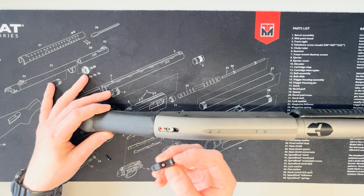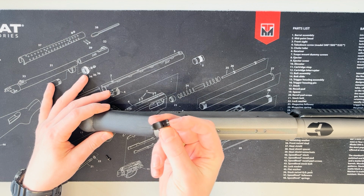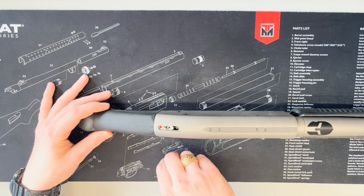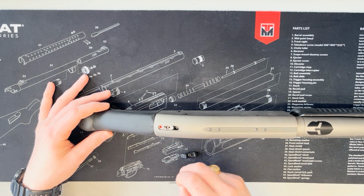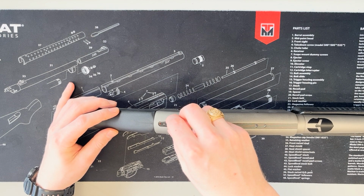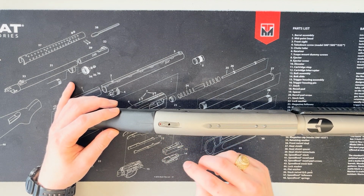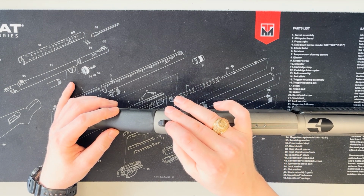Then you're going to take your safety sight and put the side that has the white safety rear sight reference facing forward. And then you can drop your screw in there. If you can get this all into one assembly, that's best. If not, you can lay your detent plate down on top. If you took it apart with your firearm on safe, then the ball should rest in this middle hole here. And then you can set your SafetySight and screw down onto the detent plate,